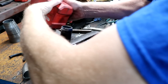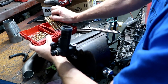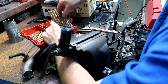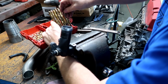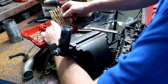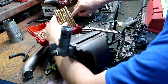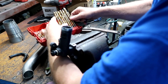What I would do is just have a drill bit that fits in there to clean the inside - let's see, maybe a quarter will do it. Next size up, 17/64ths. A little bit bigger - 9/32nds. But you just love fractions - why doesn't the whole world go to millimeters? All you European guys are probably screaming. This is such a good design too because it sits in there so tight. Sometimes when you pull it up you cut your fingers on the drill bit getting the drill bit out.